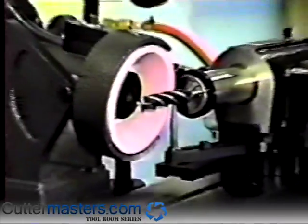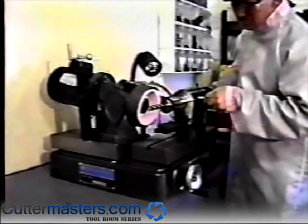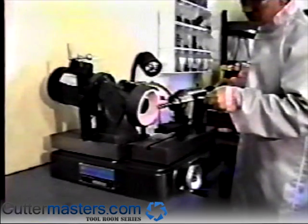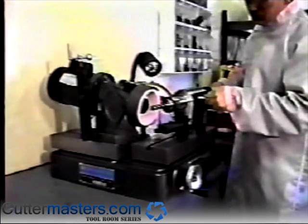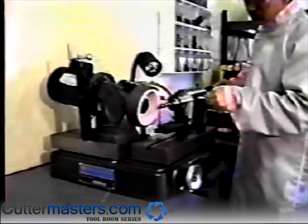For a little better finish and to compensate for wheel wear, if you're using a bonded wheel, you can take an additional 1/1000th cleanup pass on all the flutes. We suggest that you take an old end mill that is no longer in use and practice pulling the OD a few minutes before resharpening with good cutters. Once you've got the feel of this down, the rest is easy.